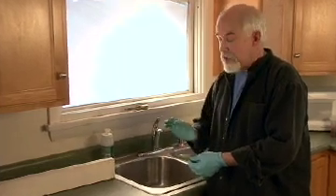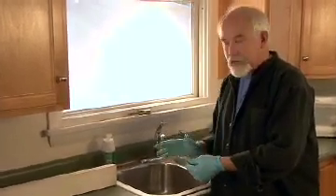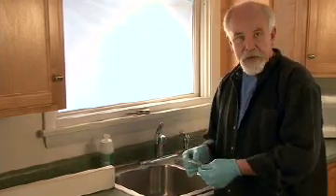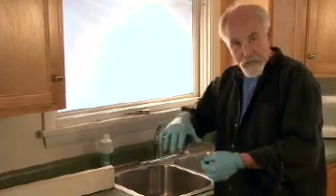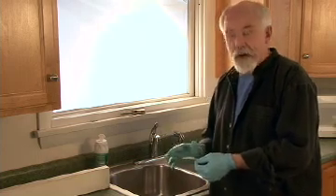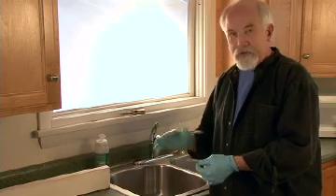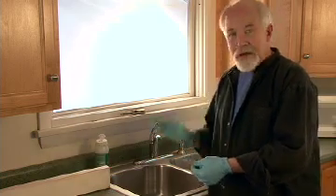How clean? Very clean. When? Just before you get started — I mean minutes. You clean the metal when you're done with it; maybe it's been pickled or washed or neutralized in baking soda. It depends on your style and the nature of the piece. So it's already been cleaned. But if it's been sitting aside, even like overnight, before I start doing any patina work, I'm going to clean it.